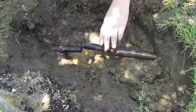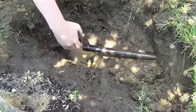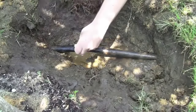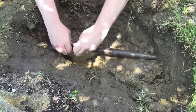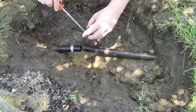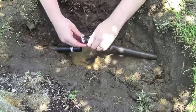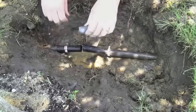Clean it up a little bit, get the mud out of there. Try to keep as little dirt as possible going into the pipe because that'll gum up your sprinklers. Now we have two hose clamps. We're going to put one hose clamp over each side, so you have to loosen them up before you put them on. There are several different types of hose clamps — I use the simple ones with the little screw on top, a little metal worm drive that tightens them up.